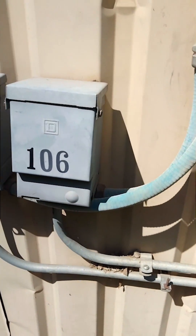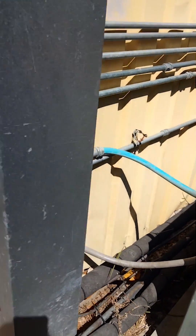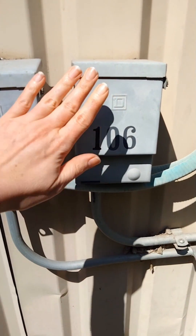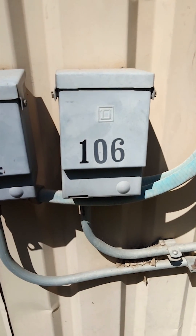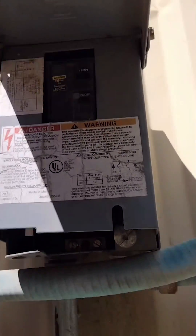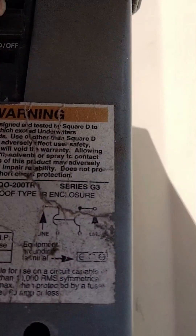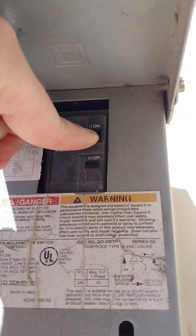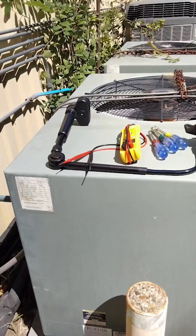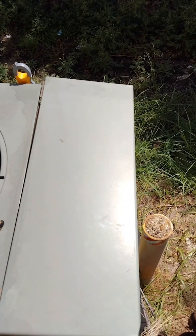Safety first. Now this is going to look a little different because it's part of our main building here, but in residential applications you're still going to have something similar to this. I'm going to work on a unit we're not currently using in our other suite. Always make sure you first cut the power — this is your disconnect. Make sure when you flip the switch you flip it all the way down and it clicks. We're not always going to trust that, so we're going to go over to our unit and first check power before we even touch the compressor.